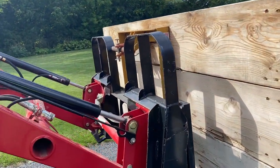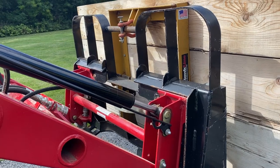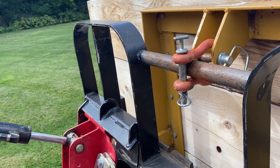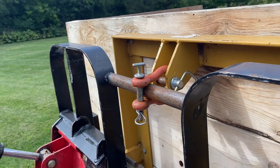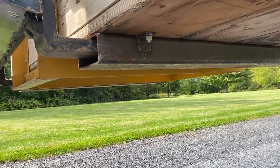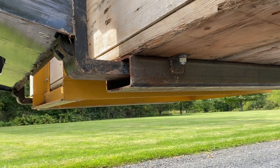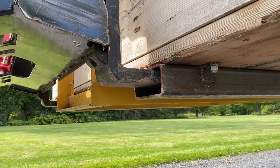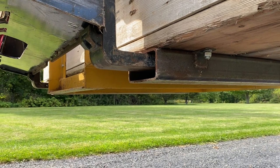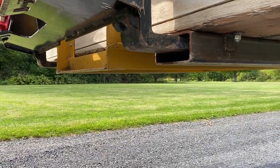I purchased this set of forks used for our tractor. Our tractor has about a 1,600-pound lift capacity on its loader. One thing I did was weld in a piece of schedule 40 pipe and made a clevis connection so you can actually dump the whole assembly. Underneath I put some skid plates — some steel into the floorboards of the carrier — so you're not going to break apart your wood. This lets you slide the forks underneath and dump the whole assembly as needed.